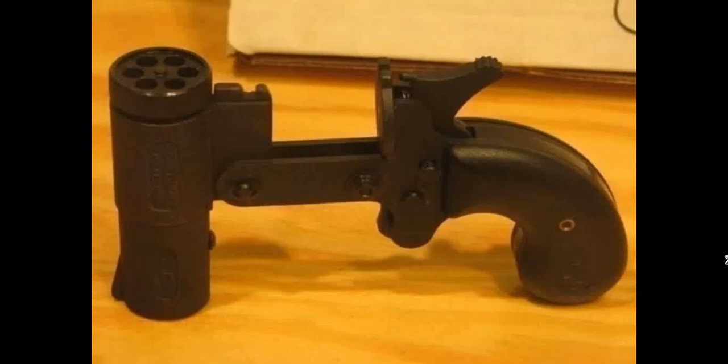This is the Cobre — we'll call it a revolver. As you can see from the number of holes, it is a manually-turned cylinder that fires six shots, .22 Long Rifle. It was put on basically a flare gun body. This body is universal between every gun they put out just about, the only difference being this metal plate. I've designed a version of this that I'm going to be releasing information about that uses a block plate and a screw, so you can change this to any of them. The universal lower receiver being set aside, what we end up with here is what looks suspiciously like a 12-gauge shotgun barrel. But because of this really thick rim with a knurled edge so it could rotate, this would not qualify as being able to chamber a shotgun shell, even though obviously someone would have tried to do it.